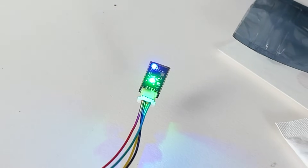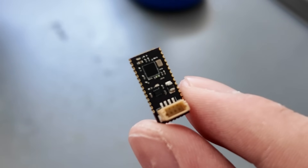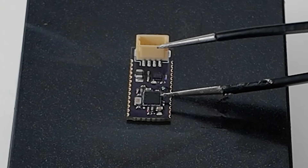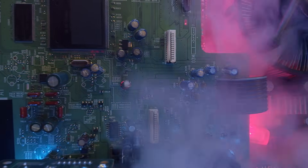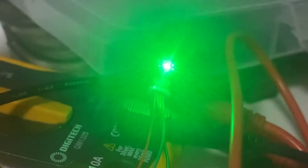After benchmarking and all that stuff, I suddenly remembered that I had accidentally pushed down on the wafer-level chip really badly during initial soldering of one of the two working boards, causing an amount of movement that looked like a short would have been likely, so I attempted to fix it. And in the process, I caused the short myself, which made some magic smoke when I powered it. So now I only have one working copy. It just goes to show you how impractical — I mean delicate — this project is. But if I were to go back and have the opportunity to do it again, I probably would, just for the memes.